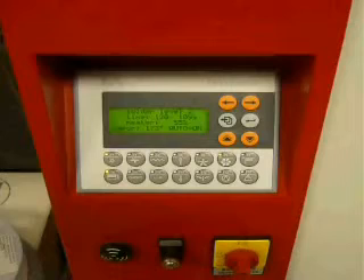This is just a quick view of the machine controller. It's a PLC based system with an intuitive button based interface. The system actually comes with an integrated chiller for the purposes of cooling, so it could literally be rolled around the shop floor and taken to places where it would be easier to reflow the product than bring the product to the reflow machine.